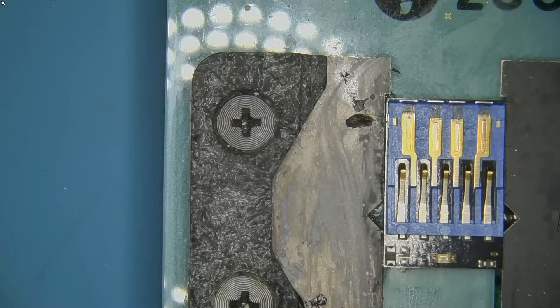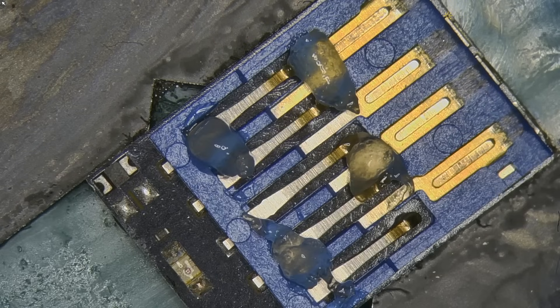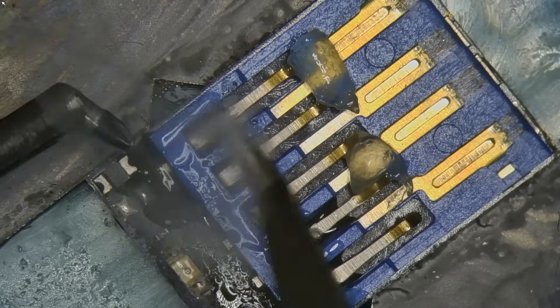Now you may be familiar with how flash drives are designed. There are basically two types: surface mount devices — here's an example of that same SanDisk flash drive in a surface mount design, with a green or blue circuit board with all components attached — and monolithic flash drives, which have no separable components, with the exception of a few capacitors, coils, or LEDs that may be on the exterior. All essential components such as the controller and NAND are inside one chip.